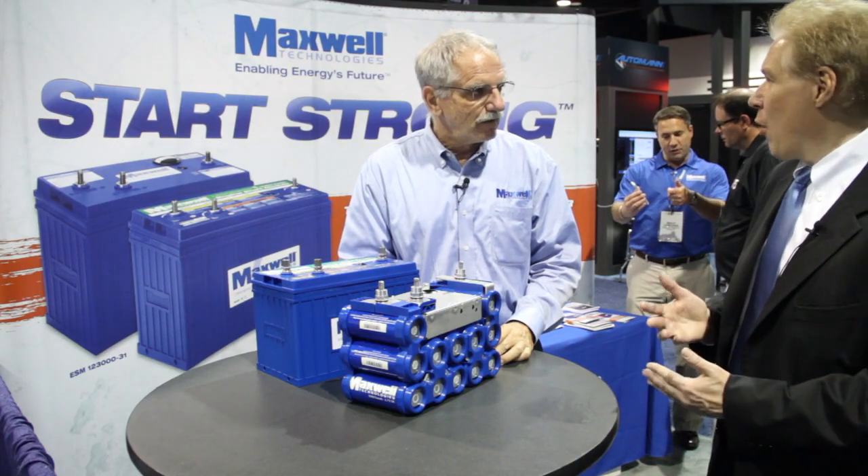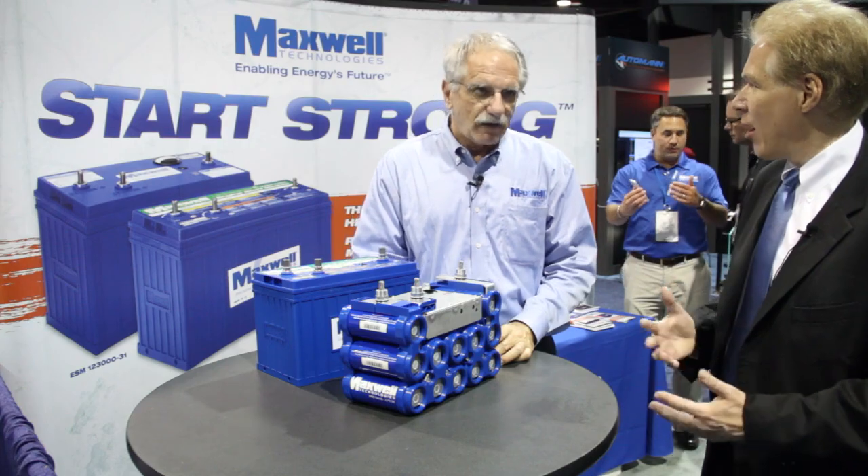You could start with just one unit where it might take four batteries otherwise? Correct. This is the inside of the unit — you see the ultracapacitors there — but the final product connects to the truck's standard batteries. We run a single line off to the starter motor, and this unit by itself takes the place of four group 31 batteries and cranks and starts that engine every time.